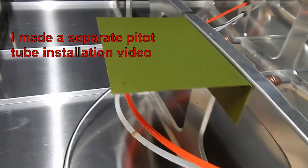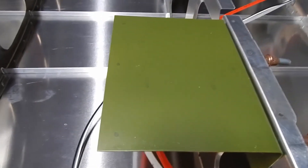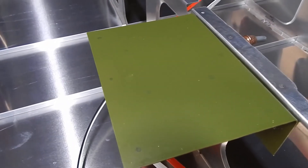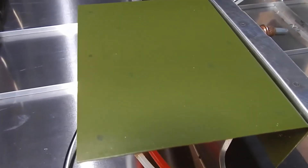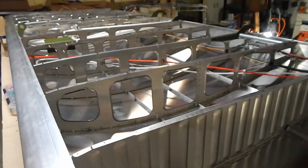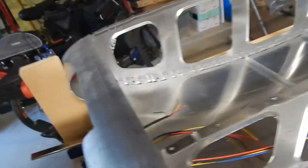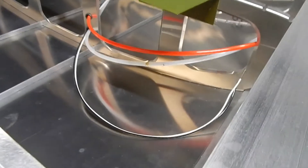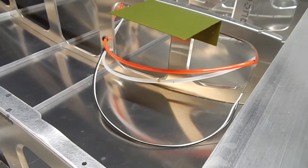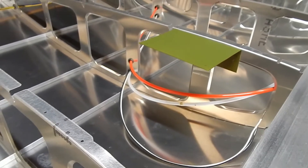With the pitot tube mount installation, I primed the bracket I made. I put five holes on this side, laid the skin on to trace it, then drilled out for the mast fabrication. I primed it figuring there might be moisture coming through with the mast, so having the plate primed made sense. I think I'm ready to start putting the skin up, but I want to get the mast fabricated first and hook up the wires to the landing light and pitot tube before putting the skin on — just to save myself some problems.